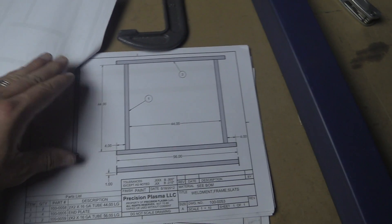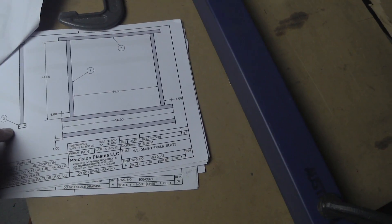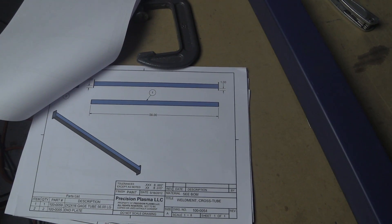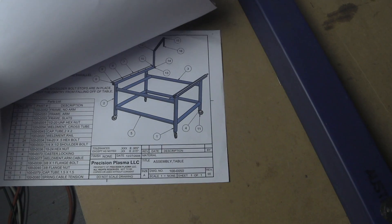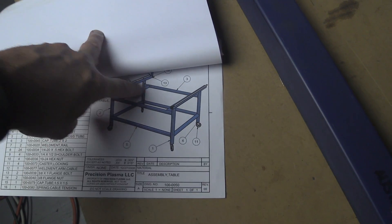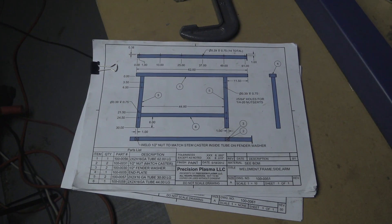So that's that one done as well. This piece here is the bottom centre piece that actually bolts onto the bottom section. You can see where all these bottom screw holes are — that's where that section goes onto. Then I have to make two of these cross pieces, which will bolt through to the top. Actually, those last ones go down the bottom, and that top frame goes there, so it's pretty critical to get that as square as I can, because that's what the plasma cutter is going to be cutting off.